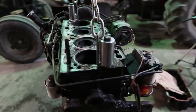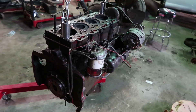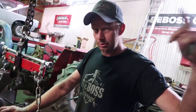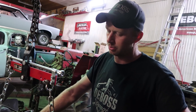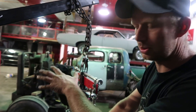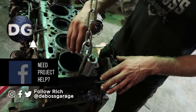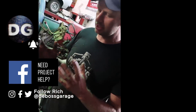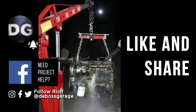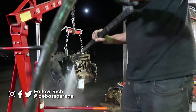The engine's out, and I can't believe I already pressure washed it because it's gross - I need to pressure wash it again. We're going to make sure nothing gets into the hydraulic lines, pull the rest of the pistons, and then pull the crankshaft out. The crankshaft is going to go to my machine shop right away to get machined - we'll probably have to take at least 10 thou off. We'll send the head right away too, strip it first. Then we'll start pulling our dry sleeves - there's a puller to pull the sleeves out, and we put a brand new sleeve in again. It is like a brand new engine. It's getting laid again already; we'll pressure wash it and it'll be nice and dry in the morning, then we can keep going with the disassembly.